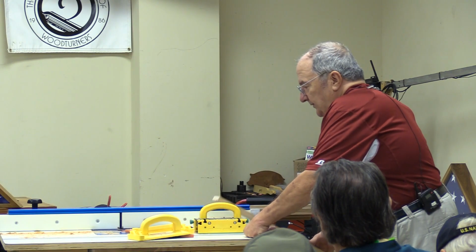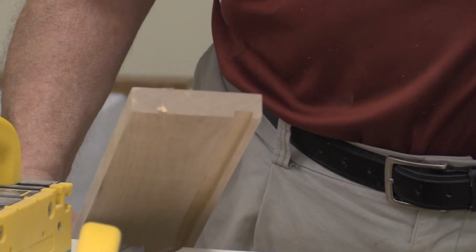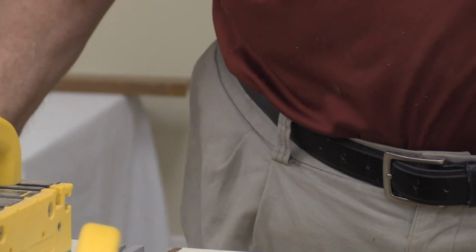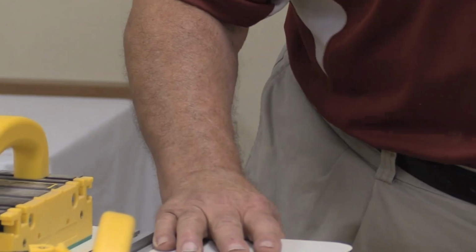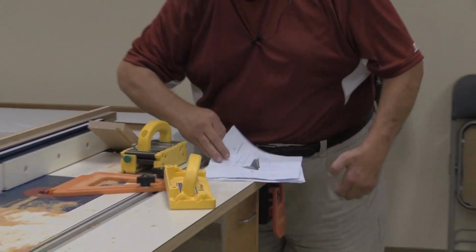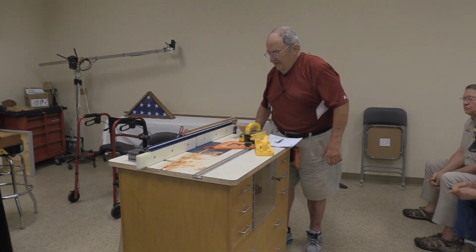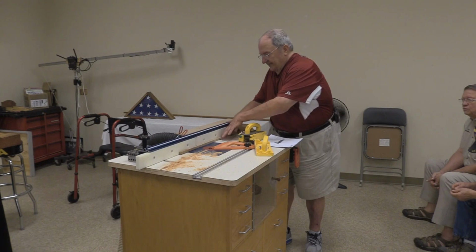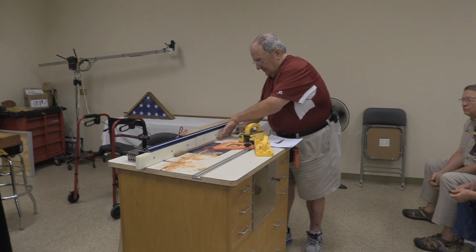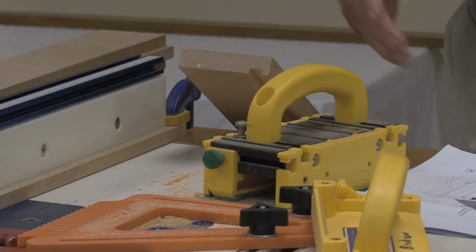Okay, now then, the next thing we need to do is step this across another 1/2 inch. There are a couple of different ways we can do that. We can break out the 1, 2, 3 blocks, clear all the stuff off the tabletop, and get the depth gauge out there and measure off the front edge again. I've found over the years that there's a whole lot simpler way to do it. You take a 1/2 inch shim, put that there, and use one of these nifty Irwin squeeze clamps. So what we just did is we moved the fence a 1/2 inch.